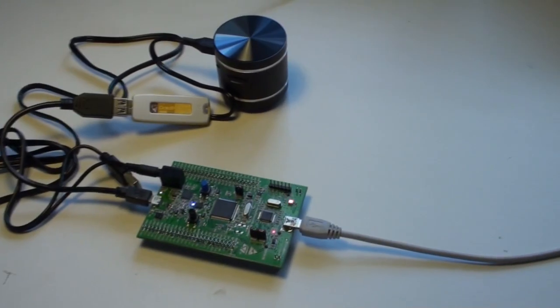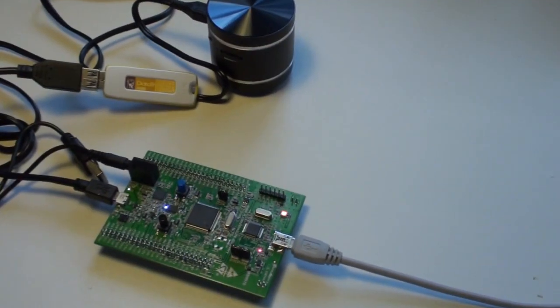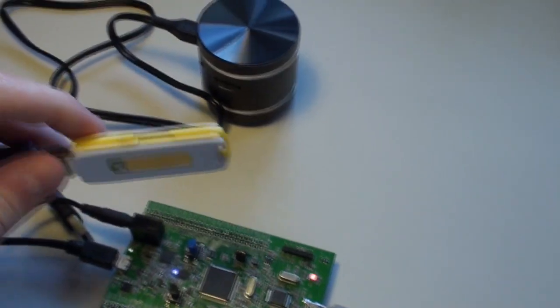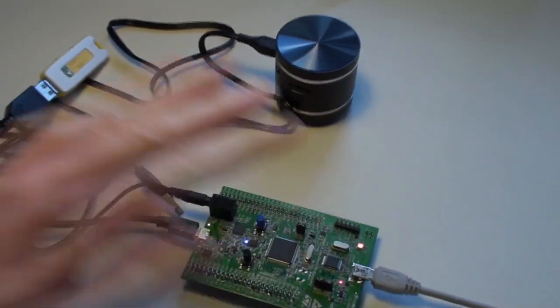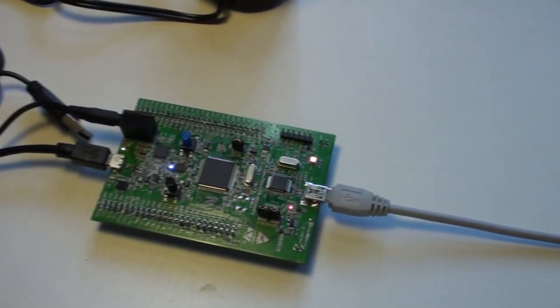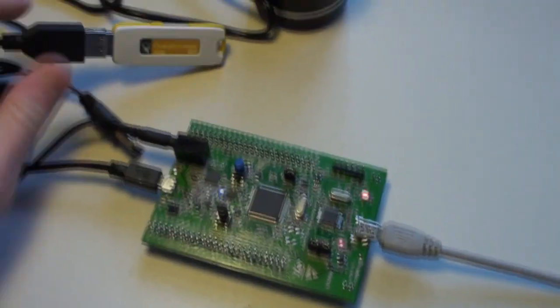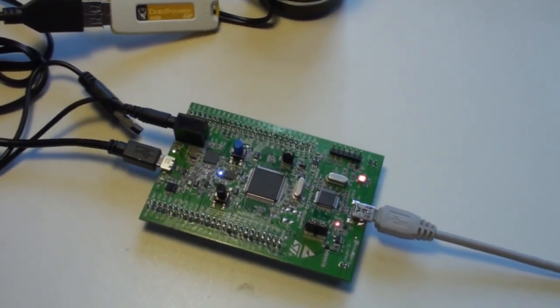Yeah, actually I think that's it for this review. I've gone through some of the examples. Another great example provided, that I'll not show, is the firmware update capability, that you can actually install a bootloader onto this. So this bootloader lays in the lower part of the flash, and then like DFU, when you are going to update the firmware, you just put the binary firmware file onto a USB memory stick, and then you plug it in, and then it will update at startup.